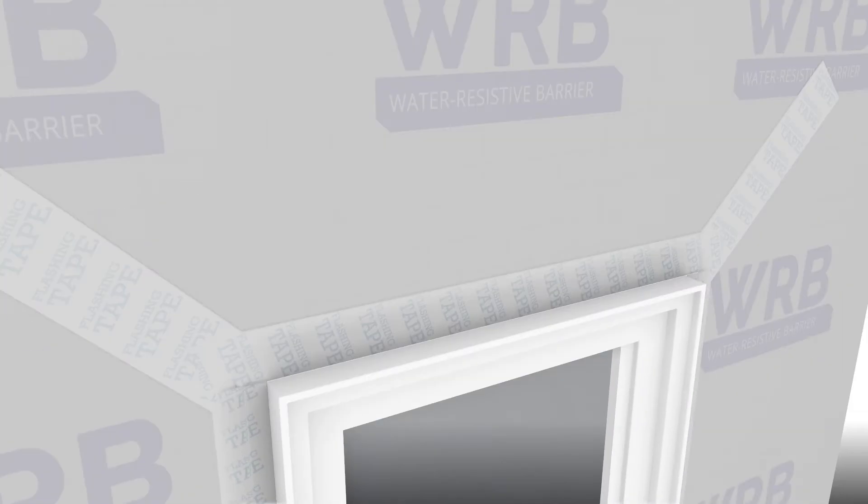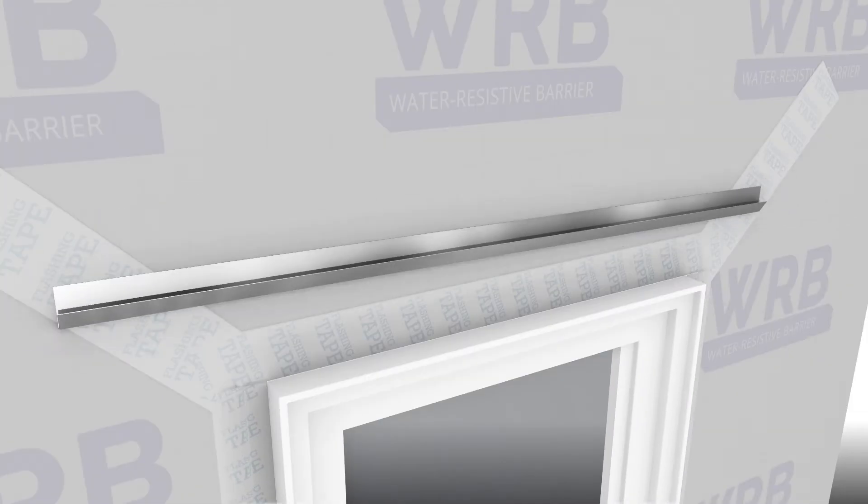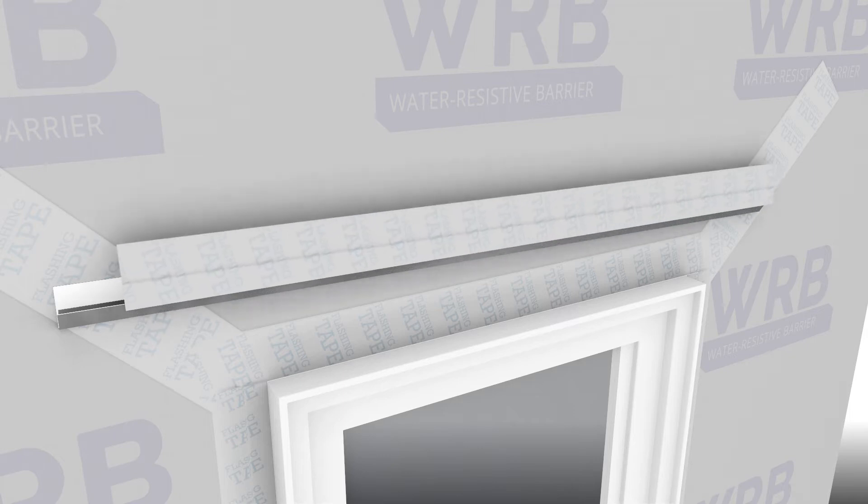Provide additional moisture protection for windows and doors by using MTI's moisture diverter to push liquid water away from the rough opening. Install the moisture diverter at a quarter inch per foot slope to drain, and extend it four inches beyond the rough opening on both sides. Then flash it with a WRB.